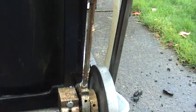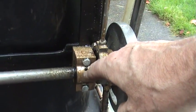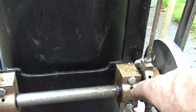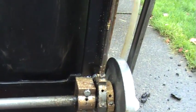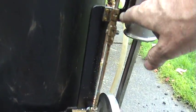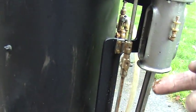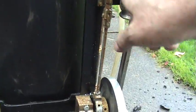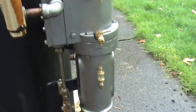There are oilers here, which you don't use steam oil on — you just use regular motor oil on all these bearings. The eccentrics here — these two eccentrics will need oil occasionally. And there's oil coming out of the engine here, which is normal. It lubricates a lot of stuff down there too. A little oiler here helps once in a while.